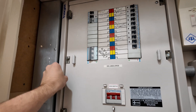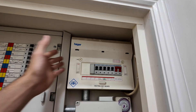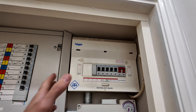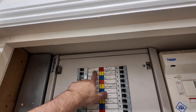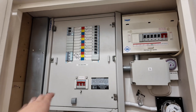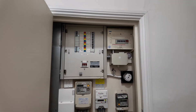So one is a metal fuse board, which is good, but this one is plastic. Plastic, with no RCD protection on any of the circuits. We've got all heater circuits - they're not socket outlet circuits but they are running heaters, and there's no RCD protection. No RCD protection on any of the lighting circuits either, except the basement one. Also there's no cover on this distribution board, but it is inside a lockable cupboard.